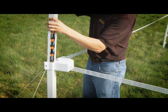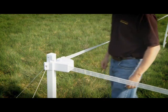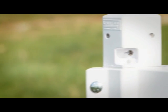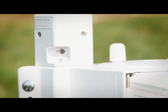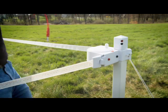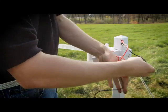Slide the fence control unit into the fence control post, batteries down. You'll want the electrical connections of the control unit positioned facing the electrical connections on the reel. Verify the fence control toggle switch is in the off or left position. The fence controller has one black and one red connector jack. The fence controller reel has a corresponding red and black connector jack. Simply connect red to red and black to black using the red and black connector cables.